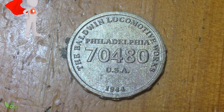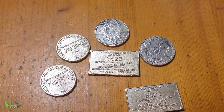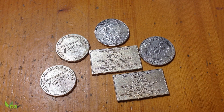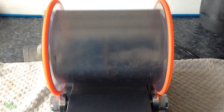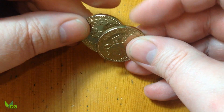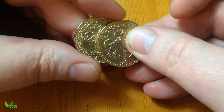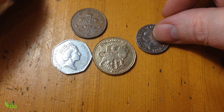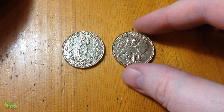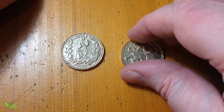He'll be looking for precise sizing, and on these circular build plates the edges are actually bevelled, so I'll leave the clean-up to him. Some of you may think that sounds like a poor excuse and that I'm just being lazy — and you're absolutely right, sorry Dick. But I did roughly true up the edges of the John Wick coins and gave them a spin in my tumbler to polish them. There's certainly a vast improvement on my last attempts. This is the first time I've cast something that actually feels like a coin — it's the right size, the right shape, the right thickness. Everything I've cast before seems more like a hockey puck, but with a resin printer and castable resin it's really possible to make a coin-sized coin.